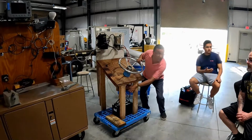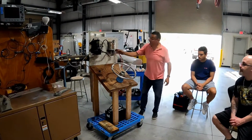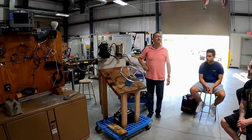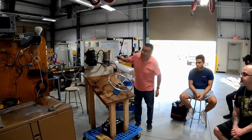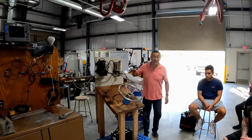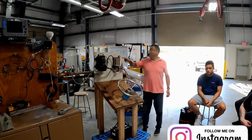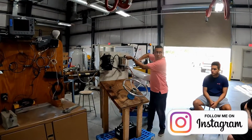And we have two lines, starboard and port, starboard and port. We cut it, and we insert this element. What is this? The reservoir. Now I have windows to check the level of fluid. With the windows I can check the color, the level, and now I have a pressure gauge. And now I can introduce air here with the pump of your bicycle.